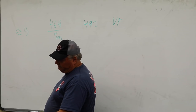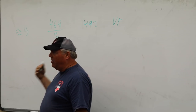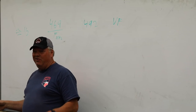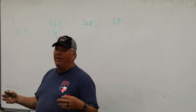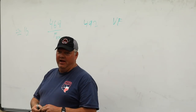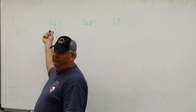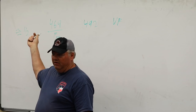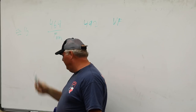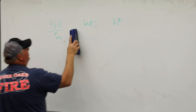So what they did is they took that, the ARRL and the folks that came up with it said, you know, copper wire in general is somewhere in the neighborhood of 0.9, 0.95 velocity factor, and they just did it for us, so we don't have to worry about it. So the 468, that's where it comes from. I just want you to be aware of where that number came from, because that's what we're going to use.